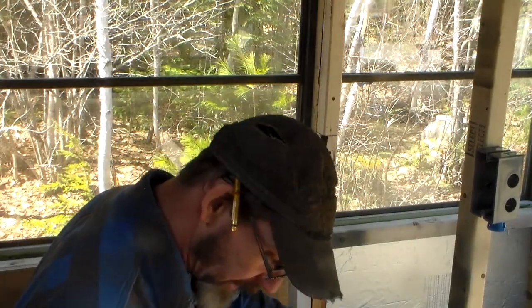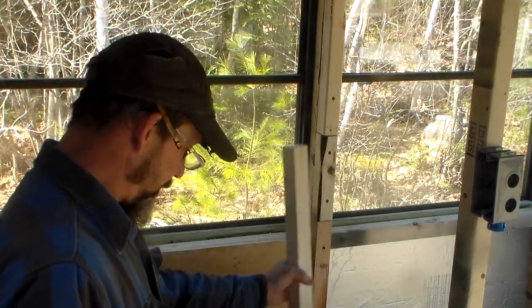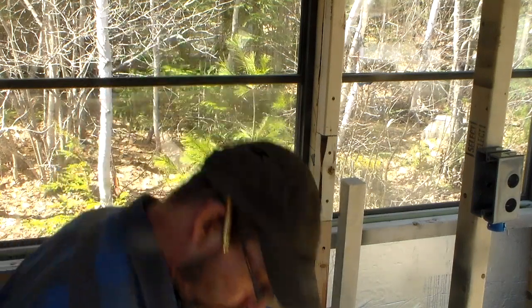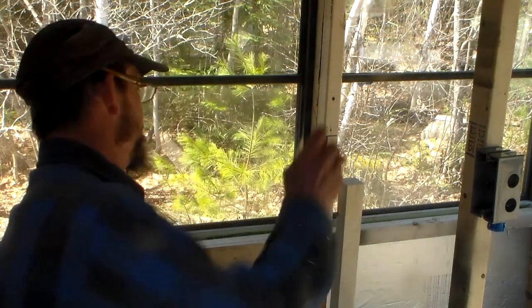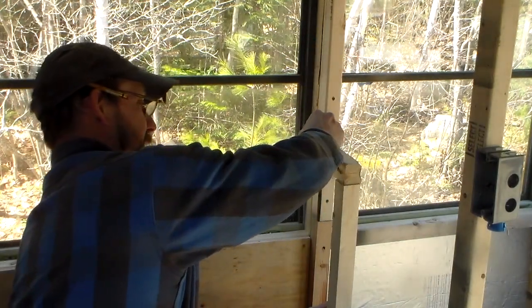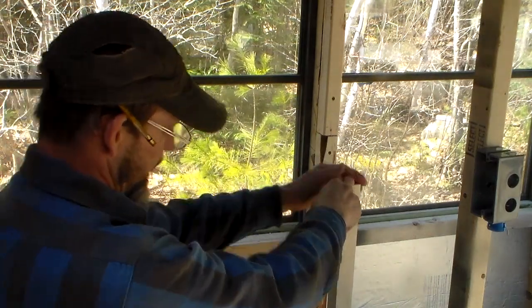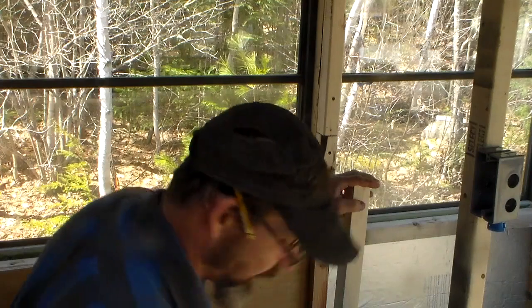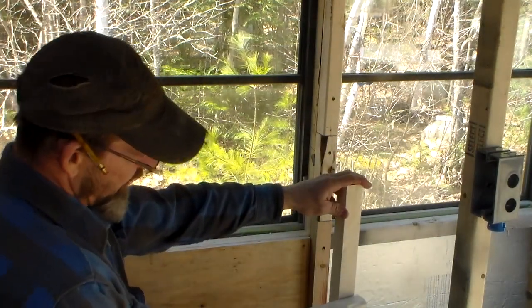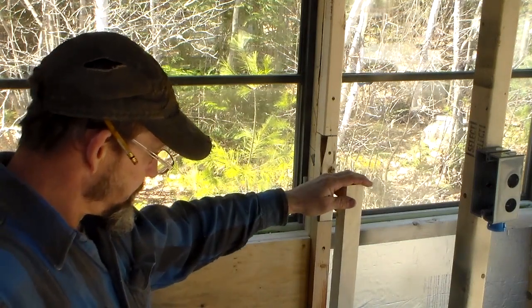Slowing a little bit as we figure out this process. Essentially the bed's going to end and we're going to have this linen closet, so I'll figure out the best way to frame it, which I think is put a post up like that, and then something across like that, and a top plate. Then we can put a lid on top of that, and then some sheathing. I don't have a piece of sheathing, but a piece of like half inch up that way. I think that's it.